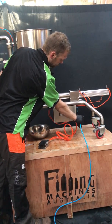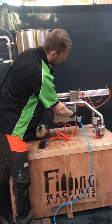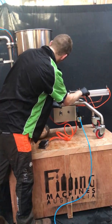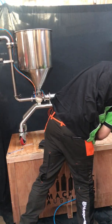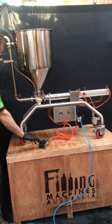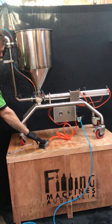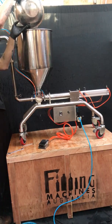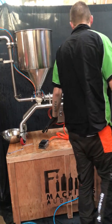This blue switch is an on/off switch. That's the emergency stop setting. We do this for about three or four full strokes — that way it ensures there's no air in the line or cylinder at all, and you'll get an accurate measurement. This isn't wasted product though, as the machine's been cleaned prior — you can place the product directly back in the top of the hopper. Once that's done, it's all purged and ready to go.